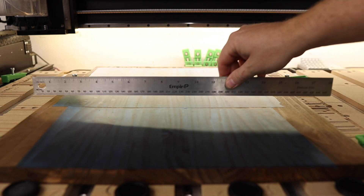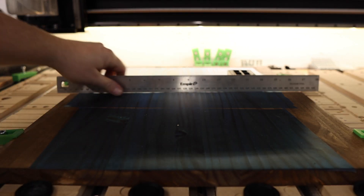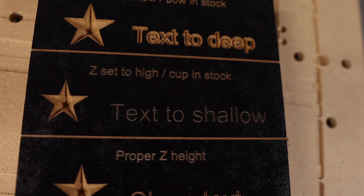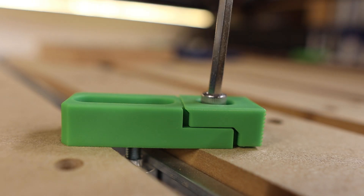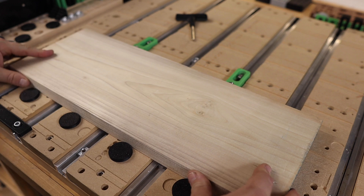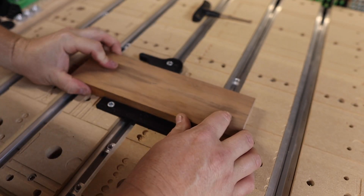If you make flags, this tip is for you. Simply place your clamps in the correct area to counteract the bow or cup in your stock, to help flatten it out. I like to apply just enough clamping force to accomplish this, and use a metal ruler to make sure I'm flat across all planes of the board. This way, you won't have any high or low spots, which will wreak havoc on V-carve stars. If your stock is nice and flat, another fast and easy clamping method is sideways pressure, or cam clamps. These push your material tightly against a fence or other stop, keeping everything from moving, and are extremely fast to set up. These are my go-to clamps when working with flat material like MDF, simply due to the speed of the setup. One or two of these clamps can take the place of four essential clamps when used in conjunction with the fence setup.